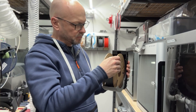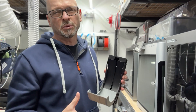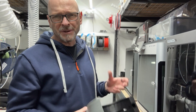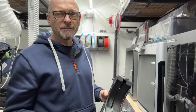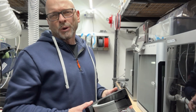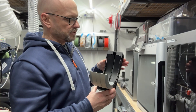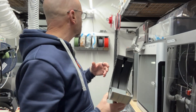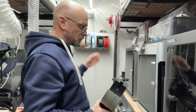It was super important that it could take a wide range of spools. But I also wanted it to take spools that were bagged. If I've got a filament — especially a premium filament — that I'm only using from time to time, I'm bagging it and vacuuming out the air. It helps me keep things organized. This slides onto the rail and there's a little detent action every five millimeters, so you can position it along the rail. If you have enough of them, you just fill the rail.